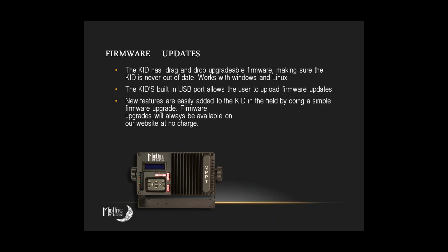Yep. If you're going to be updating in Windows 8, you're fine to do the drag and drop. Windows 8.1, we do have an updater that you will need to run to update your system first. What you will need to do is turn off any antivirus software. You'll have to download the updater, let it run, and then restart your computer. And when you restart your computer, it will restart with your antivirus software up, and then you should be fine from there. I believe you can update on Windows 10.